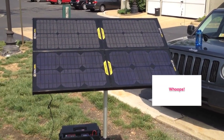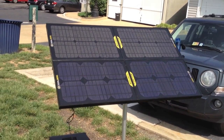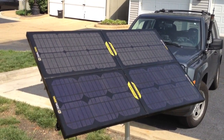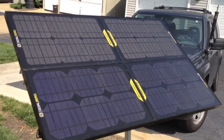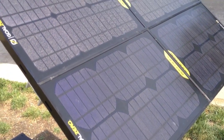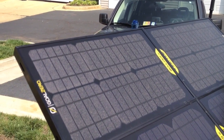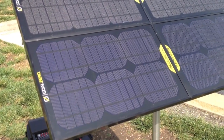One other thing I'll point out: these are monocrystalline panels, which with current consumer technology I believe are the most efficient, at somewhere between 18 and 20 percent. They're also a little more resistant to heating than polycrystalline or any of the other poured type. You'll notice the panels on the bottom have a blue tint and the ones on the top have a black tint. These blue panels are about a year old; these are a couple months old. So obviously they've switched suppliers of the actual panels, but in theory that shouldn't actually matter at all.